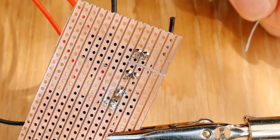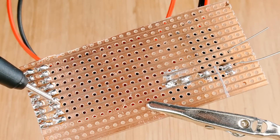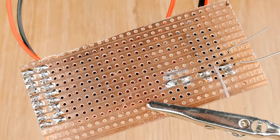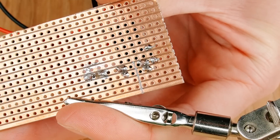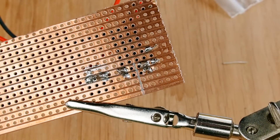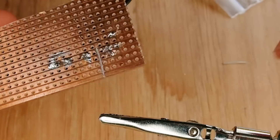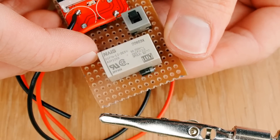To complete the circuit, we need to bridge it to the third pin of the alarm, which is the positive contact of the battery's second cell. As the relay is rated at 5 volts, but it's getting 7.4 volts from the second cell, I used a diode to drop the voltage slightly. But you can also use a 10 ohm resistor, or even just a wire to bridge it if you want, as it should still be within the coil's capability for brief periods.